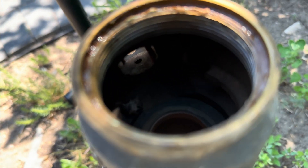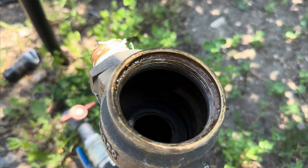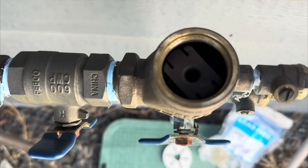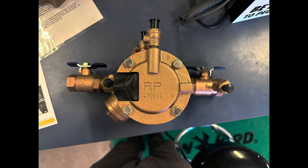So for the fix where there was a bug and a broken check valve assembly, I replaced it by buying a new one. When there are broken pieces inside, you have to replace them. Buy the complete check valve assembly kit — it has a check valve, the spring, and the retainer clip. Put them back inside and then put the bonnet and poppet back on if they're good; if not, replace those as well. For the issue where the retainer clip was out of place, I removed the bonnet and poppet — those were broken and had to be replaced — but the check valve, spring, and retainer clip were all good, so I just put everything back and replaced the new bonnet and poppet. Hopefully this gives you some confidence to do it yourself. In the next video, we're going to talk about a different type of backflow made by Febco — the 825Y, a reduced pressure backflow. Check out the next video. Thanks for watching.